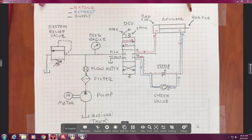Doesn't that depend on the spring as well, though? It does, and that's a very interesting thing. There are hydraulic check valves and pneumatic check valves that have a guesstimated pressure that they need to operate. Somebody takes a check valve from hydraulics and sticks it in an air circuit, and maybe it never opens. Then there's low pressure hydraulics and really high pressure, and they have check valves. The springs are really stiff. In just these hoses, you're using 50 to 100 PSI of just resistance. So it can eat that much pressure through a long line, or not even that, 6 foot. So there are funny little things. It does, but it's been designed to work with typical values. If we started at a half PSI, 1 PSI, it would never open. But normal operation, shop air is 80 PSI or 20, 40 to a machine, and it opens up. But that's a really good thing to think about.